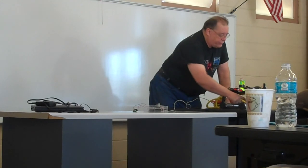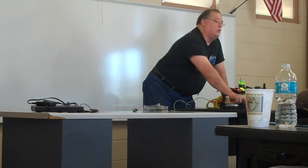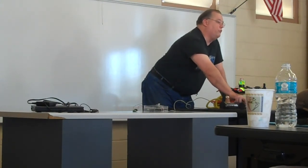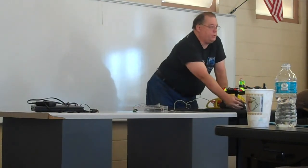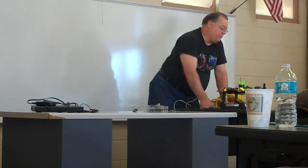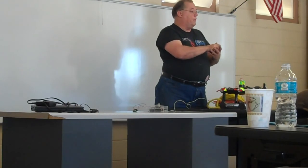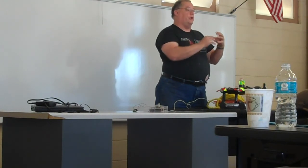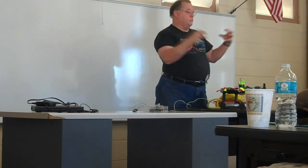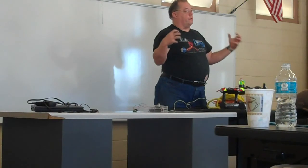Batteries are enclosed in Lexan, so I can see if there's any leakage. And they're enclosed with simple plumbing temporary caps, which means they can be removed and recharged normally. They don't have to be recharged in situ. Both wires come out the front side, so the back side is simply an end cap with a spring and one wire going up. For the center part, I used a staple brad, so that I had a hole going through the center and then this big surface area that I could glue against. And then it acted as a button in the front of the long string of batteries. And in the back, it sprang out of the flashlight, so it was just like an oversized flashlight.